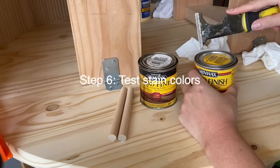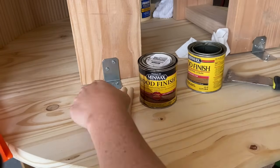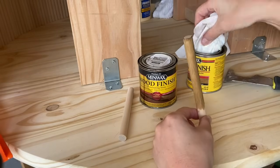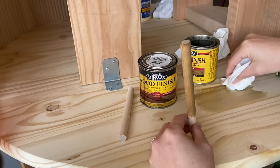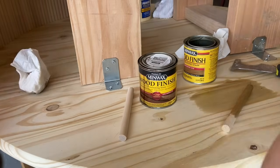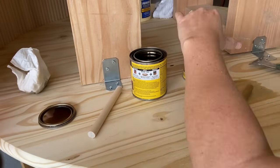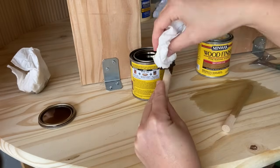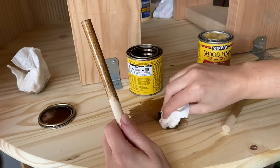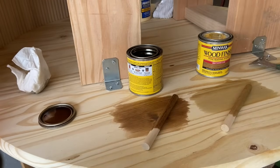While that wood glue is drying, the best thing to do is test out a couple of your stains on the inside. I tried a color called Early American by Minwax and also one called Driftwood, also by Minwax. Just the little sample sizes — plenty for this project at $5 each. Take a paper towel or rag and dab a little bit on the dowel and tabletop to see the colors. Let it dry for a good 24 hours before you choose — it takes time for that stain to penetrate.